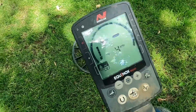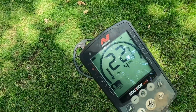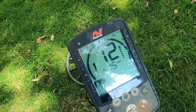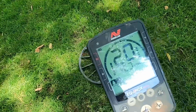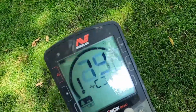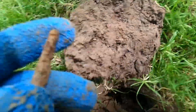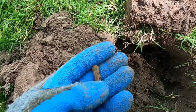I'm going to go to 4 kilohertz. It looks good on the screen, but it's really choppy in my ears. It's got a lot of iron. Start the multi. Okay. Oops, you didn't see that. See how that number cut way down? I think it's going to be another wheat penny. Let's check it out. No, actually that was a nail, and 15 kilohertz actually sounded the worst on it. Multi sounded a little bit better, and 4 kilohertz sounded the best on it.